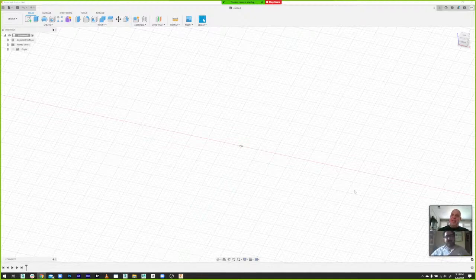One key thing I've learned with Fusion 360 is you should have calipers, because anything you're trying to match in the real world you want to measure first. Here's a piece of three-quarter-inch Baltic birch plywood — this is not actually three-quarters of an inch, it's in fact 0.7 of an inch. So before I do anything in Fusion 360, I grab the materials we're going to mill and put the calipers on them. Sometimes it's 0.7, sometimes 0.71, sometimes 0.65.